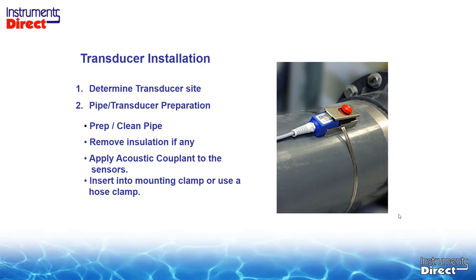To prepare the pipe, just wipe off any loose material — you don't have to take a grinder to the pipe surface. This transducer comes with a pipe mounting clip — a little stirrup — that you strap onto the pipe and slide the transducer into. If you lose the clip, a hose clamp will work too — it is not critical to the installation. Apply your acoustic couplant, slap it to the pipe, crank it down, and you're in business. If you have the choice, the best place to install this is not at 12 o'clock or 6 o'clock — install on the side to get the average solid content inside the pipe.